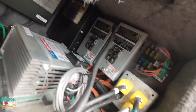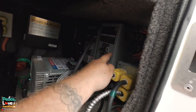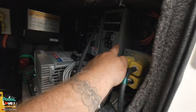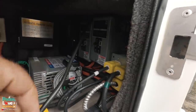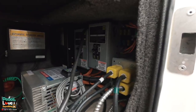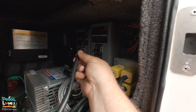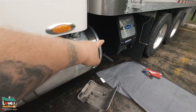If you see this cable right here, this was wired into this breaker. The problem with this breaker is our shore power also goes into this breaker. So with this being wired into it as well, one of the problems we were having was when we plugged up to shore power and turned the breaker on at the shore power box, it was sending a surge of electricity into this. But since the generator was connected to it, it was sending a surge back down through this cable, out here, and goes to the generator, which kept tripping the breaker.